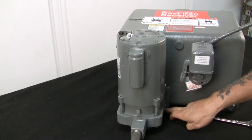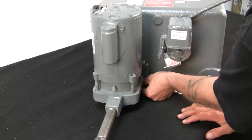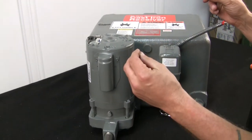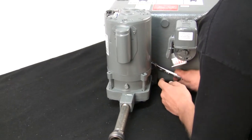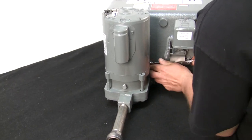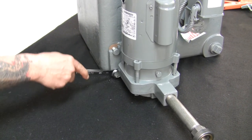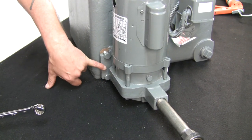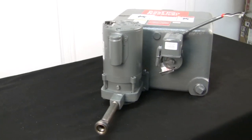In this scenario, again, because they notch that volute, you can just leave it rest on those two bottom bolts. And that gasket's not going anywhere, and the two surfaces will meet, and you'll pinch that gasket in there real nice. So, at this point in time, we'll just tighten up the flange to the tank. And again, be careful, it's only a cast piece, so you don't want to over-tighten these. Just mush the gasket, because you can snap these ears off, and you don't want to snap the ears off because it's very expensive.